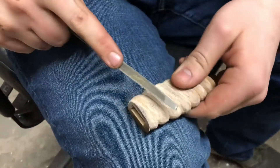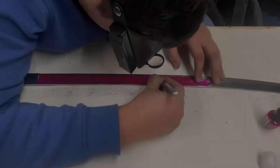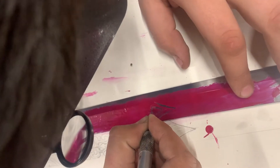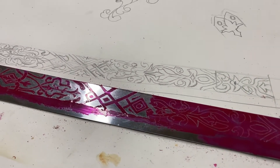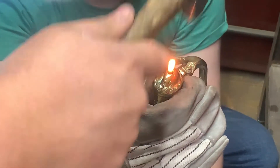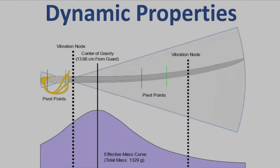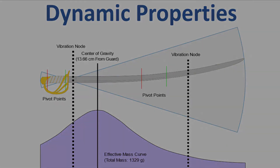The handle was wrapped in white rayskin and brass thread. The team recreated historical floral scroll patterning above the ricasso using an acrylic paint and an improvised electro-etching technique. The handle of the sword was secured by peening the tang. A blade balance calculator program was used to measure the effectiveness of the blade design to ensure optimal balance.